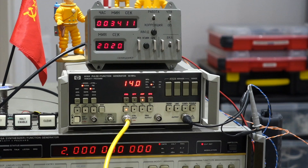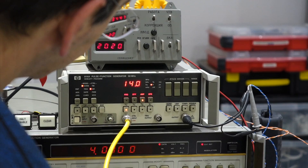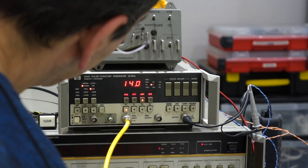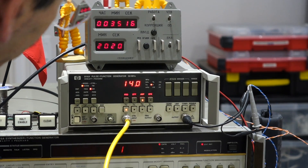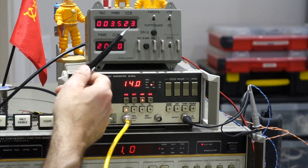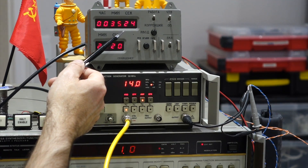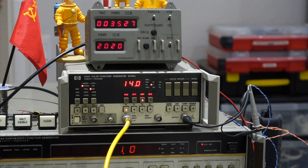Now to prove I'm not making that up, I'm going to change this to 4 Hz — 4.0000000 Hz. And you can see that the clock is going way too fast. And I could put it at 1 Hz, and now it's going atomically a second too slow every second, switching every two seconds. So what it wants is 2 Hz — there we go, and now it's the correct period.